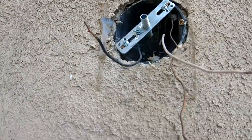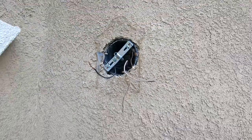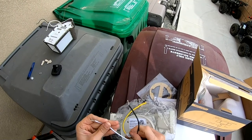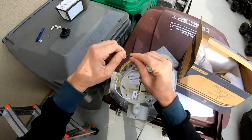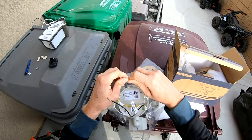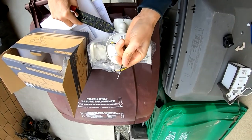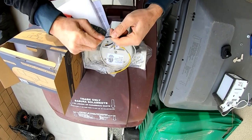Here's a close-up of the black, white (which is kind of beige), and the bare wire, which is the ground. On the floodlight I see there's a black, white, and yellow wire with a green stripe — that's the ground wire. Whenever I purchase a light or device with wiring, they never expose enough of the wire, so let's strip these more. Score the wire and pull. You want to twist these clockwise so when you attach them to the other wire, nothing loosens up.